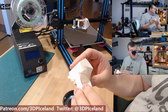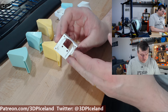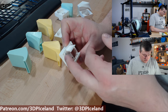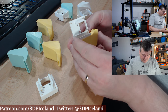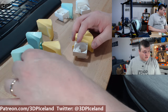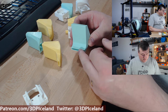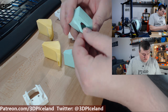I have several designs on the table to show you. The first part I designed was the mount itself for the hotend fan, and I got that made pretty quickly in Fusion 360. I had to adjust it afterwards a little bit to have space for the cables, and this one here is glued to this part when I was testing. The fan duct itself — this is just the first type — had a very big hole and was not directed in the best way. This part was blowing a lot of air just in front of the hotend and not on the part itself, so this was actually a failed print.